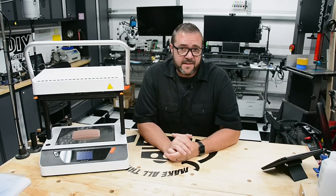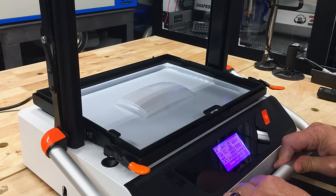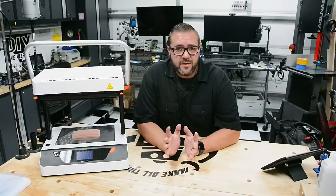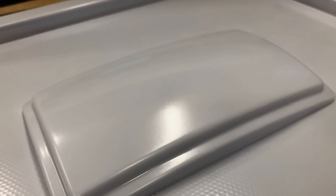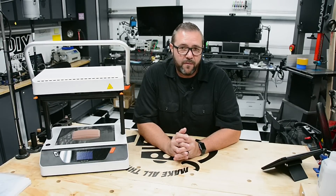With the buck centered on the device, you pull the bar down to break the magnetic force, then proceed to push it all the way down, fully locking out the arm bars. The vacuum quickly evacuates the air, then switches into a deep pulling mode. You'll see the plastic form tightly onto the form, and if you don't, there could be something with the seals, or you'll need to go back once it's cooled to confirm the seal is fully seated and your buck is properly designed. For us, this thing looks perfect — if it were the right material. The form is excellent in drawing into all the edge details of the design. The correct material is somewhere in delivery, so let's move forward.